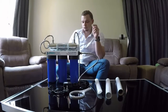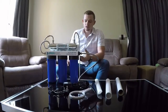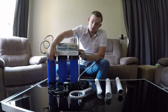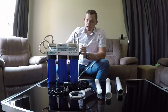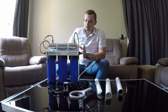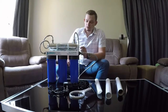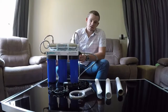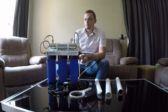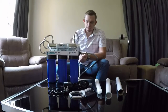The first thing to do is open the faucet and start letting a little bit of water run through the system, and check if you have any leaks. Check at the two connection points at the edges of the UV light and around the top edges of the filter housings. If you find no leaks at low pressure, close the faucet, let the pressure build up, and then check again. If there are leaks on the fittings, redo the connections or check if the hose is old. For leaks at the housing connections, just check they tighten properly — if there's a small leak, tighten a little bit with the spanner. If that doesn't work, open the housing and refit it, and that should solve any leaking problems.